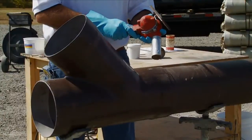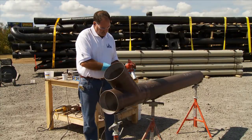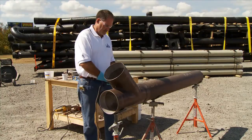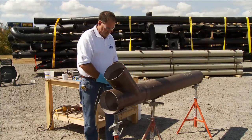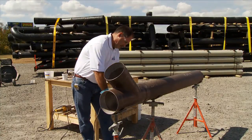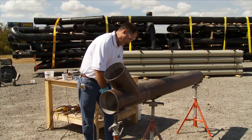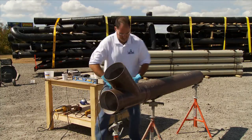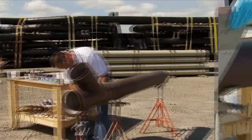You can accelerate the curing time using an electric hot air gun. The normal amount of time to get a joint to gel with an electric heat gun is approximately 5 minutes. Be sure to keep the heat gun constantly moving so as not to have excessive heat on one spot. After about 3 minutes using the heat gun, the adhesive will not come off when touched. At this point, it should be left for an hour to cure.